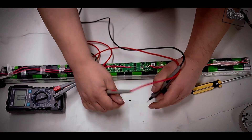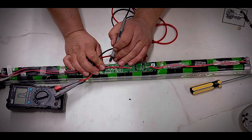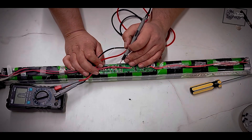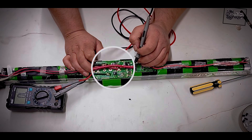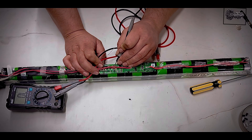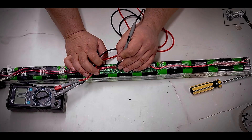What you need is a special diode. In this system, this is the minus/ground side, this is the charge side, this is the discharge side, and this is VP — the cell side. When charging happens, the charger gives more voltage than this BMS needs and the voltage rises, especially at the end. Because these diodes are no longer functioning, it blows this fuse for safety. Replacing these two diodes is a must.